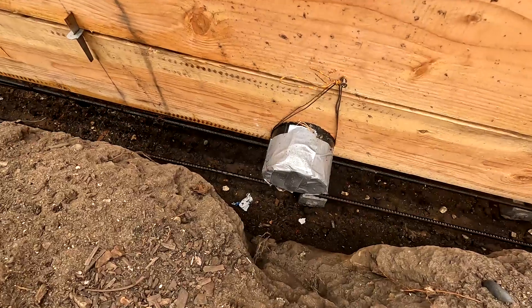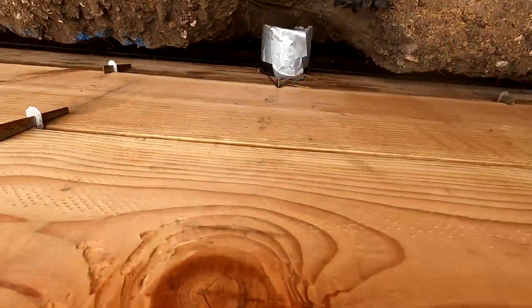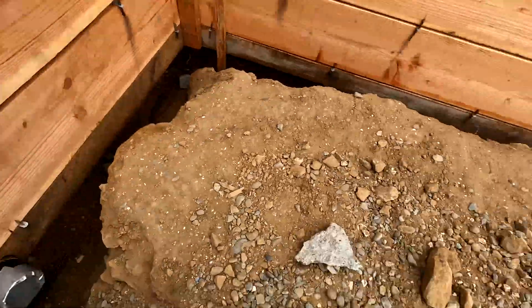The other thing we do within the wall before concrete is poured is we put in what are called sleeves. Sleeves are typically made out of ABS plastic — think of it as an ABS pipe. We keep those sleeves in place so that after concrete is poured, those sleeves act as conduits. In the future when we make connections for plumbing — sewer connections and water connections — those connections are made through the sleeves so we don't have to make holes in the foundation. Here I'll show you the sleeve for a future sewer connection. It's a four-inch pipe because the sewer pipe itself will be three inches. The sleeve goes all the way through the foundation, and after the concrete is poured when we start doing plumbing, we'll put in the sewer pipe through the sleeve.